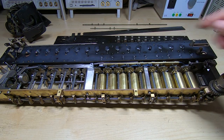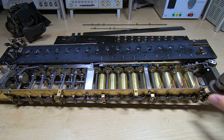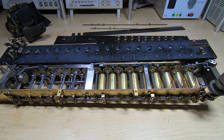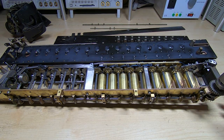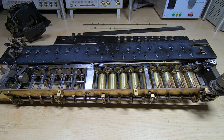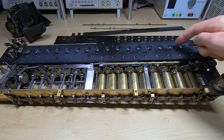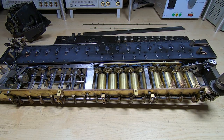So I've got 10 set and we should end up with a result of 10 if it's working. I press the plunger down - the motor would normally start up. It's much easier to turn than it was before, requires almost no force at all. A one has appeared in the second column and it should now take us through to the end of the cycle and switch the motor off - which it has done. We've ended up with a value of 10 in the top, which is good - that's zero plus 10, and we've got a value of one in the intermediate, so that's one operation. If we do the same thing again it should add 10 to our previous total of 10, giving us 20. It's now showing 20 in the top and two in the intermediate - two operations.